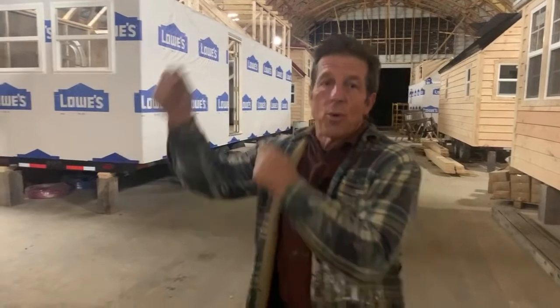How many buckets of stucco to stucco a home? That's a good question. We're playing around with that. There's a square footage process, like 150 square feet per bucket or something. It all depends on the applicator. We really messed up on our first house. The guys didn't know how to do it, and they were using the trowel, and they put way too much product on. We went through half our product on the first coat, and we had to double coat everything, inside and outside. So I did a little bit of a different process, and we're going to do a video on it. We roll it on the wall, and then we use our knife to spread it out.